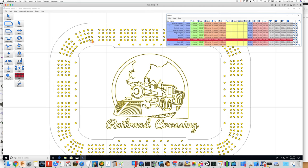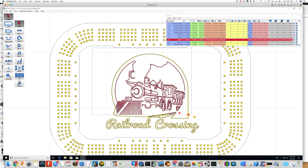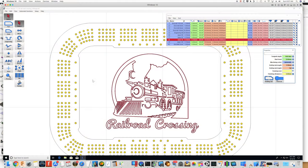Now we need to select these lines again because I'm going to be milling a pocket here, three millimeters deep, so this should actually start at three millimeters. I did that in reverse — you should set the starting depth and cut of the pattern before you tile it. If you do it after tiling, I've experienced trouble getting all cuts down to the correct starting depth. Make sure you do all the settings first on the original image, then tile afterward.